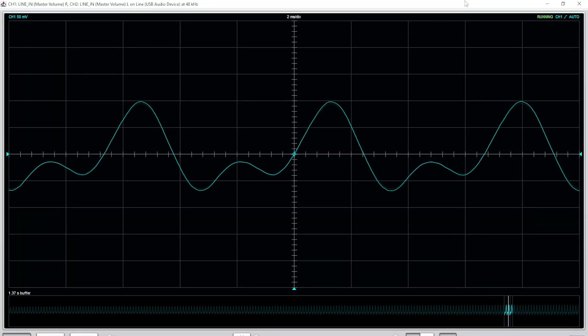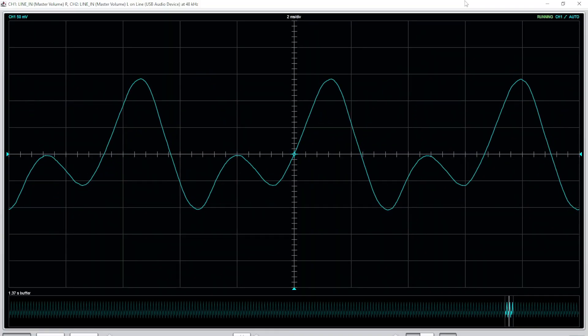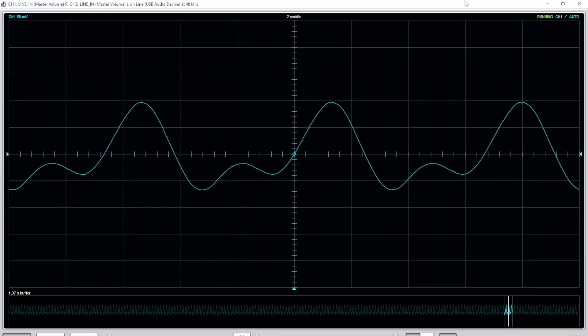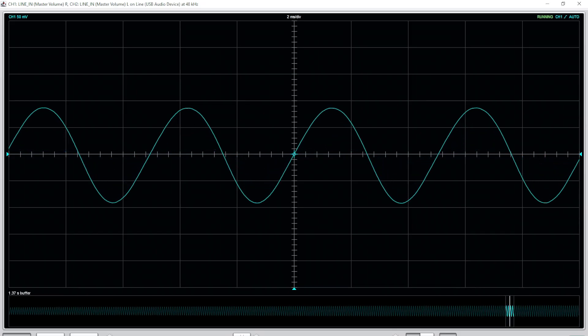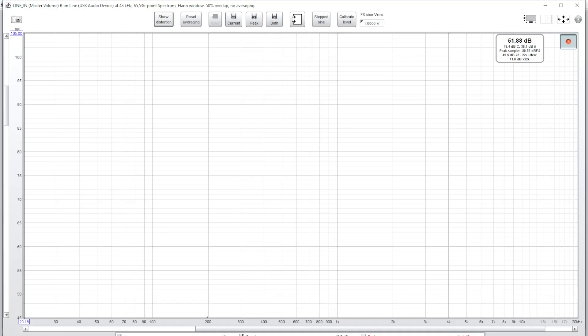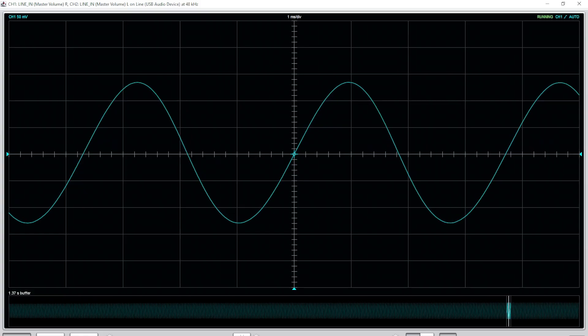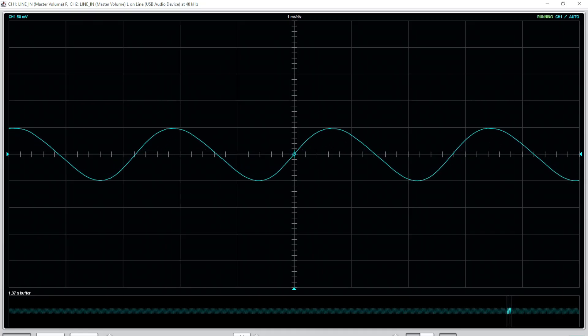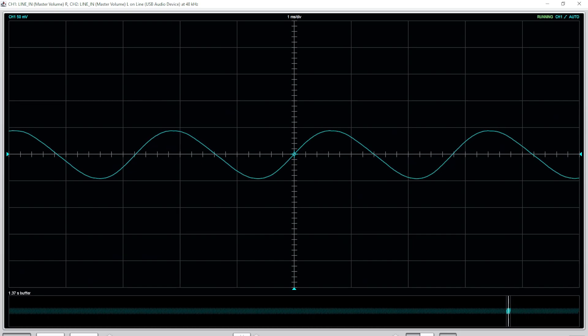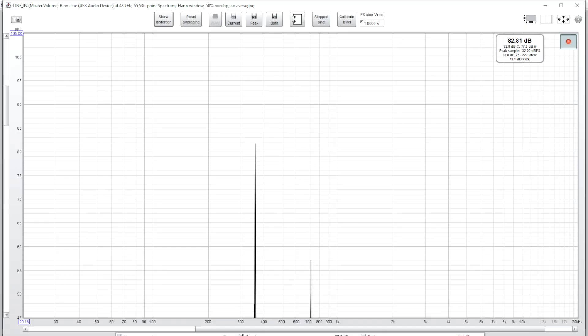Right from the start there's just no bottom to that sine wave at 25 scaled Hz — it's just a massive harmonic, what a mess. The fundamental is instantly raced up the graph by the second harmonic, reaching nearly equal amplitude by the end with a bunch of others coming in too. The 33 scaled Hz at 198 Hz looks way better — stark contrast, standing pretty much on its own on the RTA until the limit. The 270 Hz is quite loaded by this line and the sine wave looks pretty beautiful — the fundamental is on its own for ages before the second comes up very minimally. Not even a third or fourth harmonic in sight. The 360 Hz looks okay but it's leaned back slightly — probably the cone finding a new oscillation center — and the second harmonic is about half the amplitude of the fundamental.